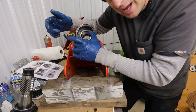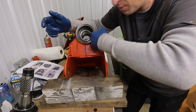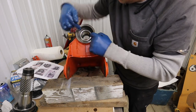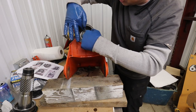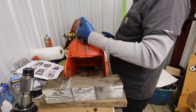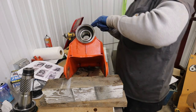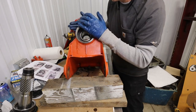The outside of the donut cylinder seals on this part of the housing. And so the effective area of the hydraulic pressure coming in is right here on this cylinder. It's right there. So as that pushes on it, and that's where your porting comes in, right here. That's your port from this O-ring there, O-ring there. Well, that bolts on here on the side. You've got your port on the bottom, and on the top, you've got your port pushing it the other way.